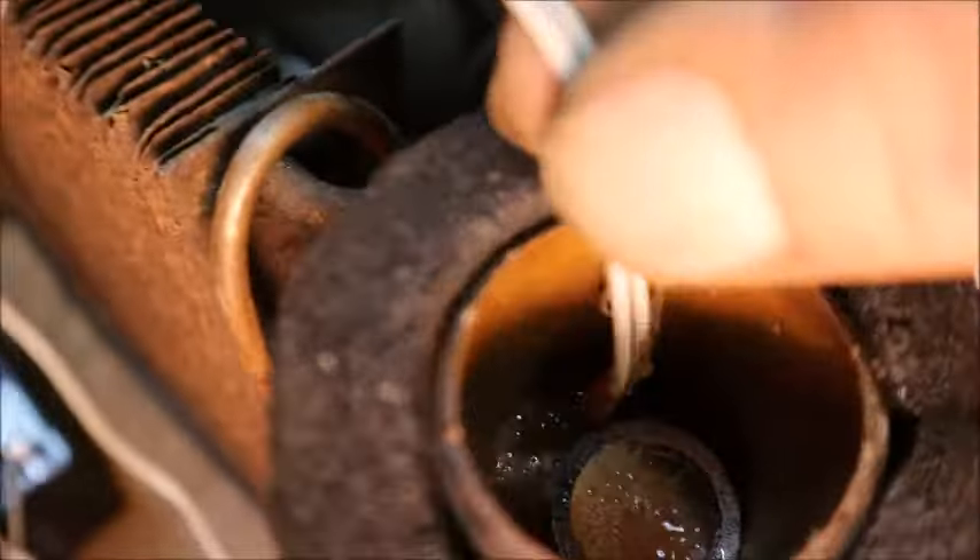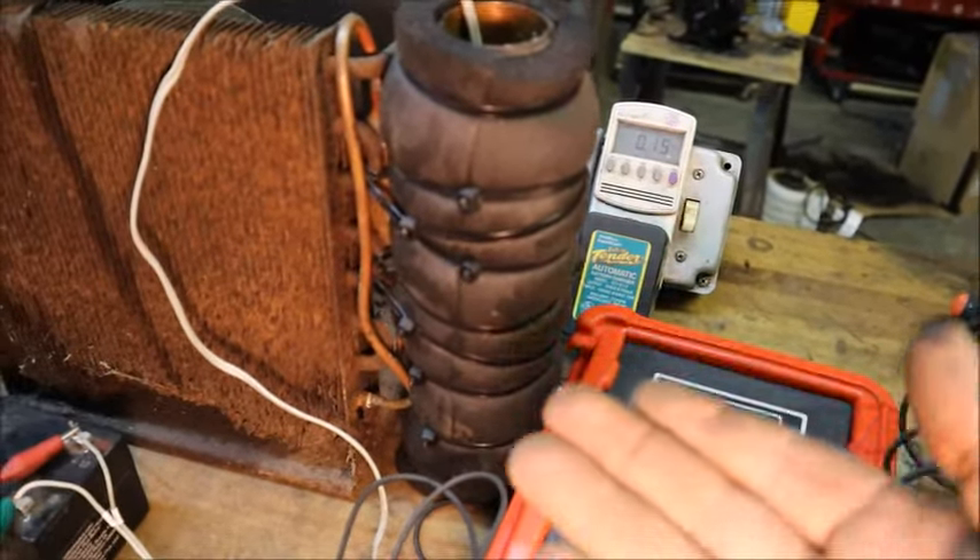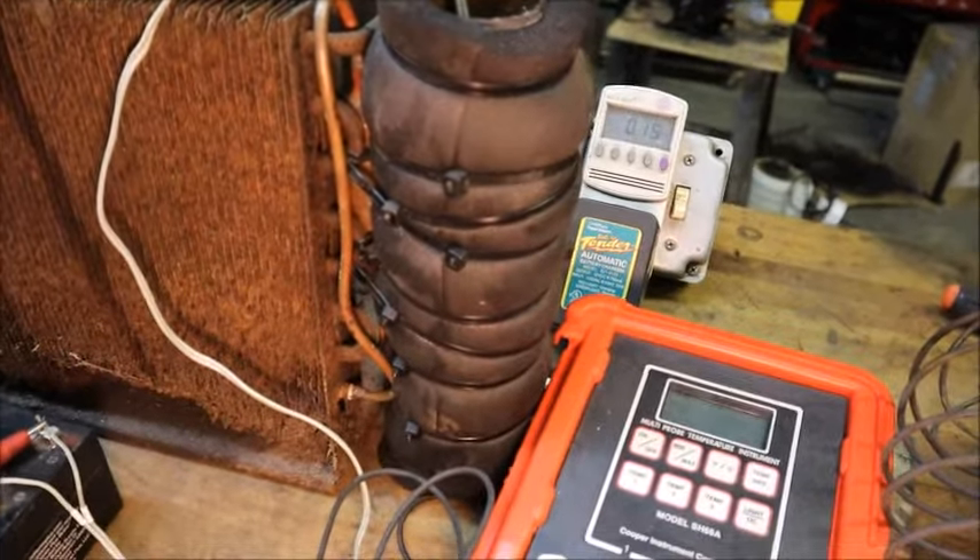The only downside is that it's not automated at this point — I'm planning to do something like that, but for now it's manual. The compressor is way oversized so the temperature drop is very quick, too quick to catch the exact point where the thermostat switches. I have to run it a few moments at a time and work the temperature down. Once it's getting close to cut out, the temperature rise is gradual so that side works pretty well.